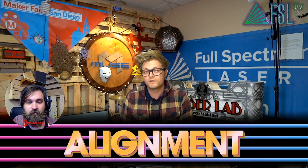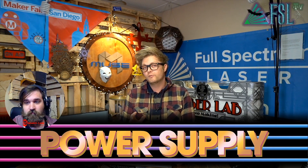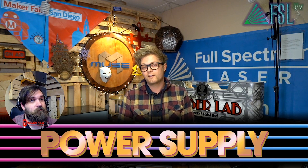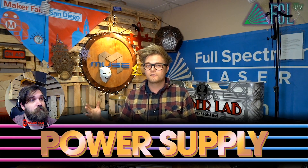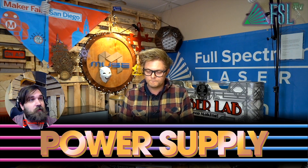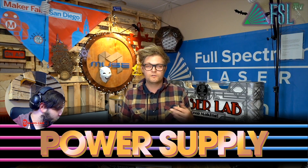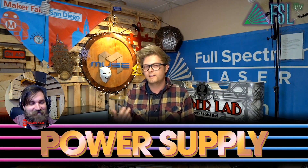And if it's not your alignment, then you're going to talk significant possibilities — it's going to be your power supply or PSU. If you're not firing, it could be the power supply further down your workflow of checks. Always contact support at this point, because there are a handful of little things you don't know. Maybe your power supply is okay, but maybe there's a loose wire and you're just not getting power to the tube. I had something disconnected from my power supply — a grounding issue. I didn't actually ground it to the machine. Power supply was just, you know, I think I know too much, threw it in there and didn't ground it — I was having issues.